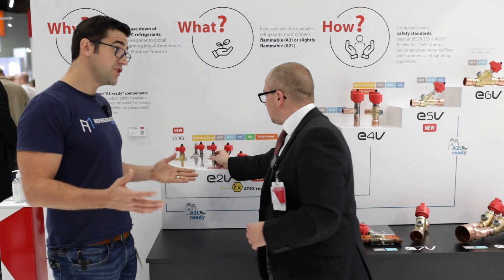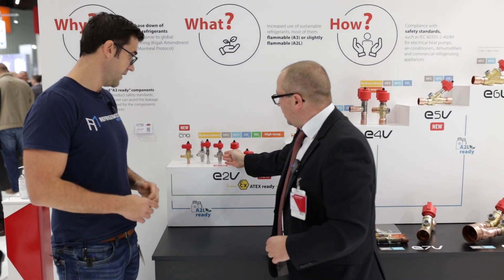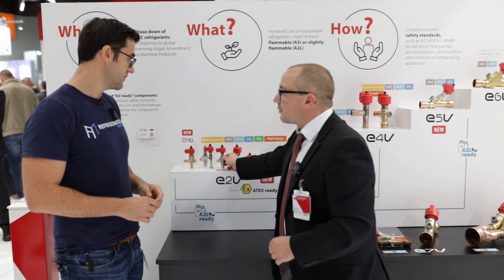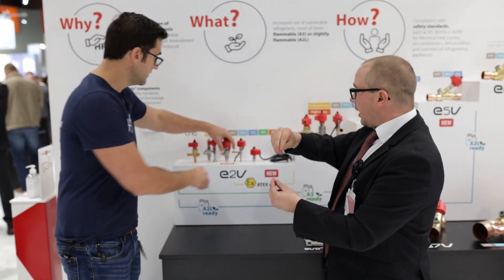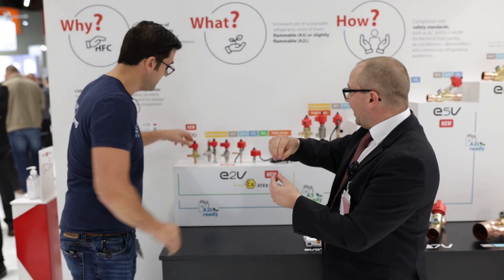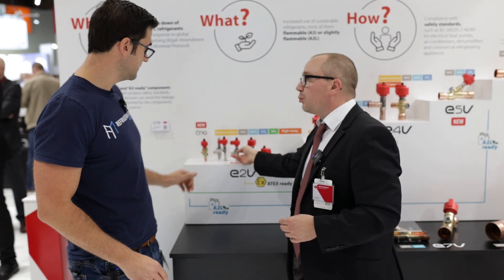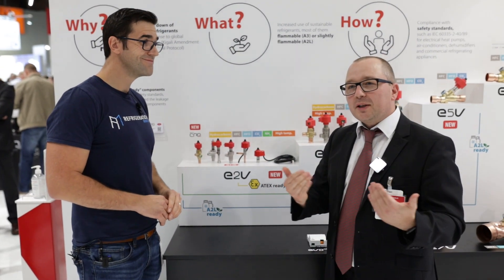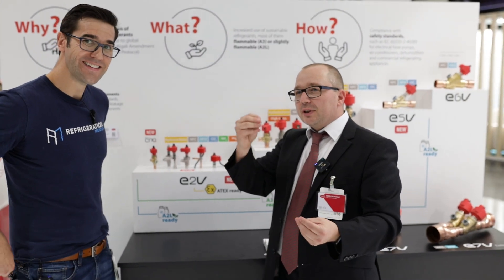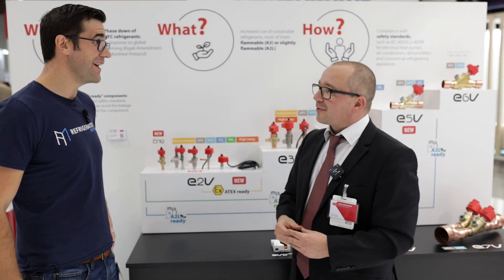You can take this apart, which is a huge advantage. Inside it's a complete cartridge with a needle. Some valves have sight glasses, but not the CO2 ones — at CO2 applications it's quite difficult to see what's inside and to interpret it correctly. That's really tricky.